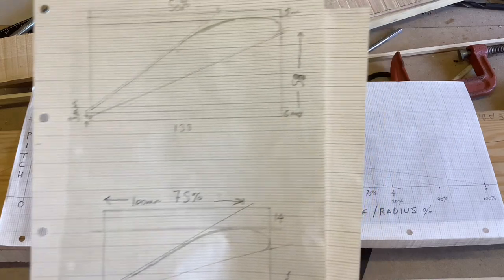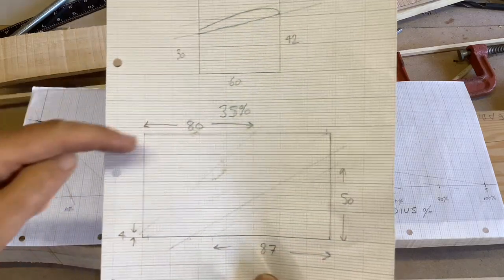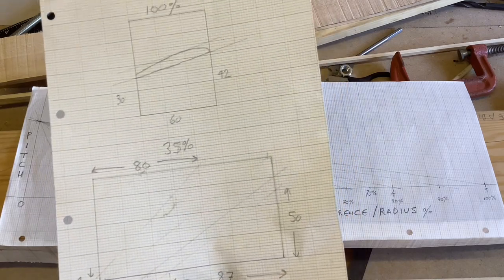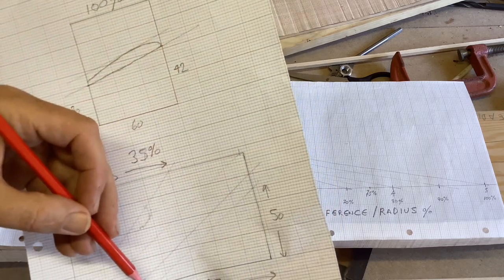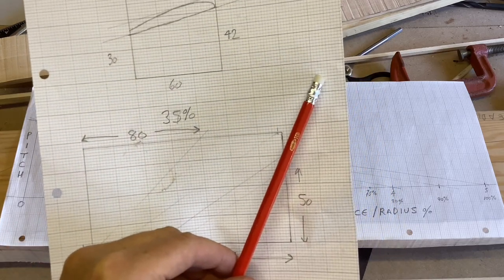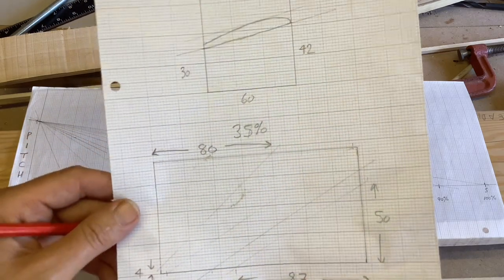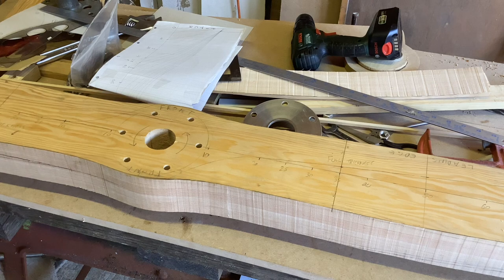I measured the angle by counting across and up using the squares on the paper — no protractor or angled tool needed, just carefully counting with a metric ruler. The 35 station is a bit more tricky: we know it's a full height blank and the blade profile around 35 won't be flat on the back — it'll be slightly curved — so I've had to mark the straight line fairly far out knowing I'll need to take more off with the saw before chiseling. Those are the only four stations I've done, then I marked up the propeller blank.